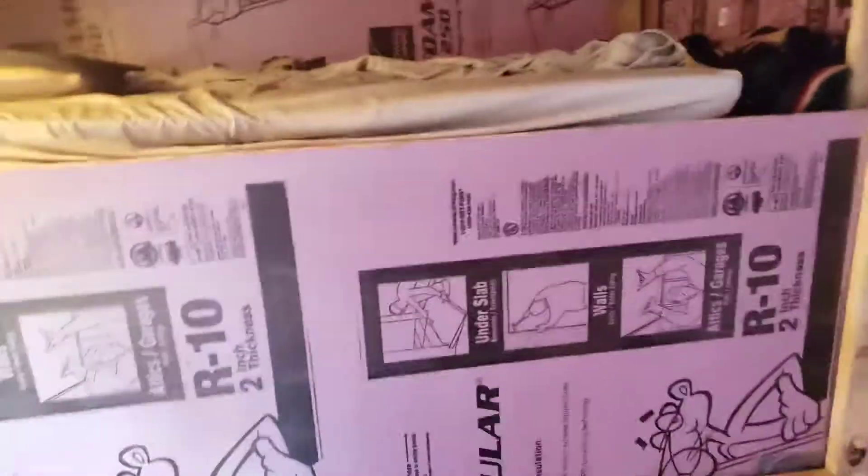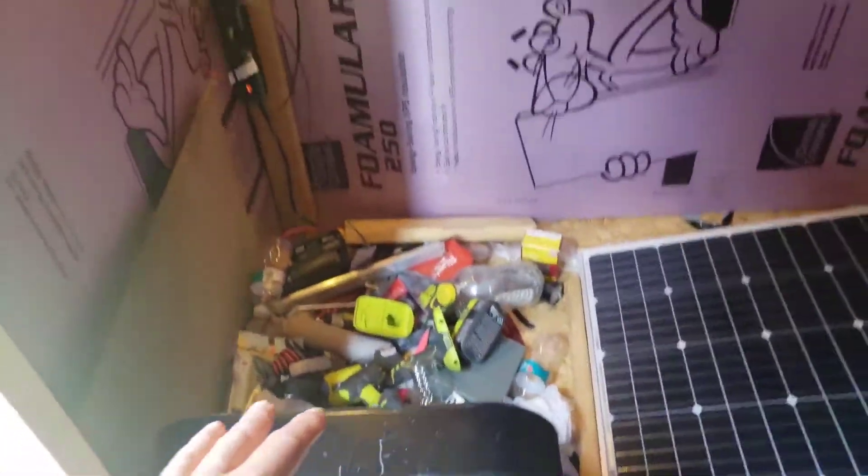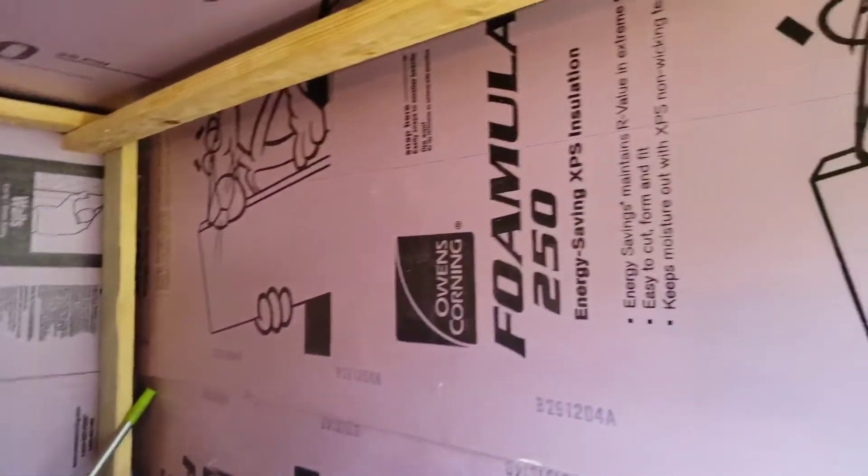I've got a portable folding camping chair, and that's basically it on the inside — I can sit down, do stuff on my table, and there's a little box fan here. I used scrap two-by-fours to frame it. This isn't traditional framing because that would have used a lot of two-by-fours and been too heavy. Since I'm using rigid insulation anyway, I just need something to hold the insulation in place, and it's nicely fitted together pretty tight.